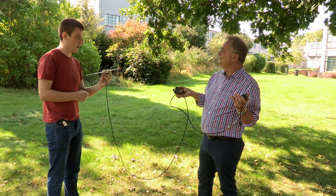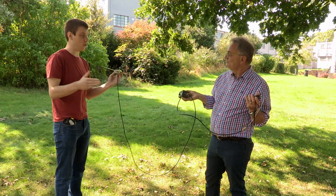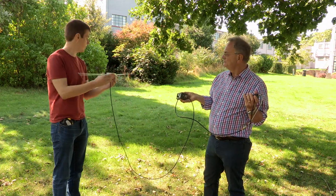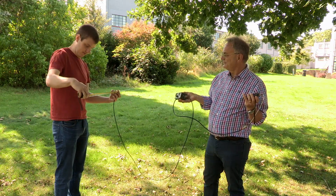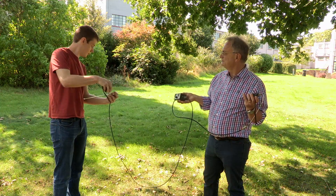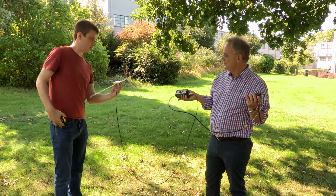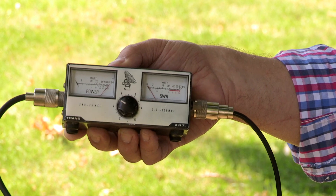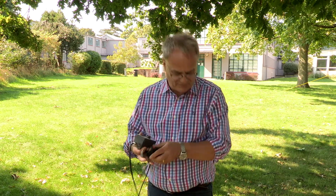Oh, that's gone up now. So you were nearly there before. The antenna will not work if it is too long or too short, and we have overshot now. So if we decrease it a bit and check again - a moment of truth - look at that, we have a perfect SWR of one. That's our two meter dipole perfectly tuned. We've demonstrated the principle.